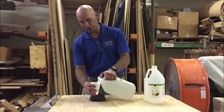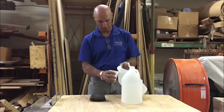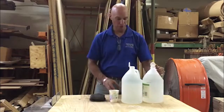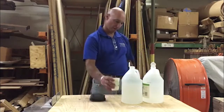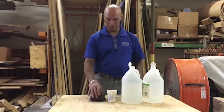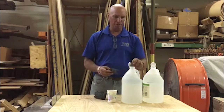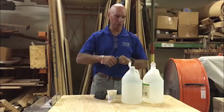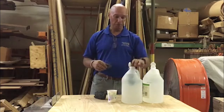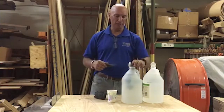So I pour off this — I know this is a nine ounce cup so I'm going to take about half of it out. I should have two relatively equal volumes of iron acetate; if not, I can just add a little bit back. Now the precise measurements can be important but I make mine the same all the time. I'm using 4-0 steel wool — it's super fine so there's a lot of surface area for the steel wool to react with. I've also washed it previously with some lacquer thinner and let it dry out so there are no oils from manufacturing getting into my solution.